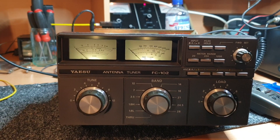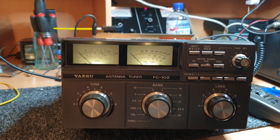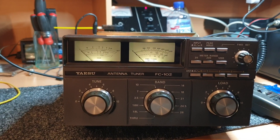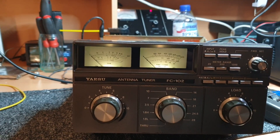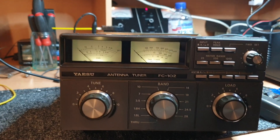The FC-102 was probably one of the tuners that should have said 400 to 500 watts max, when people were trying to put a kilowatt through them back in the day. But generally the relays could put up with a bit of power, and certainly everything on the coil is not too bad.